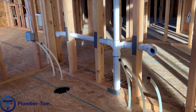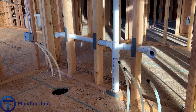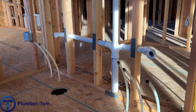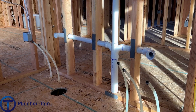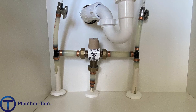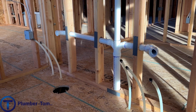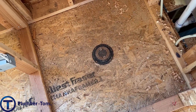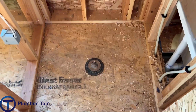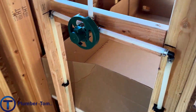You might notice there's an extra PEX supply line over on the right side sink. This plumber was thinking ahead — that's going to be a line that sends hot water under the floor over to the tub so a mixing valve can be installed right there in the cabinet. Very convenient. Good foresight, good planning. The plumber did a nice job centering the drain right in the middle of the shower space.